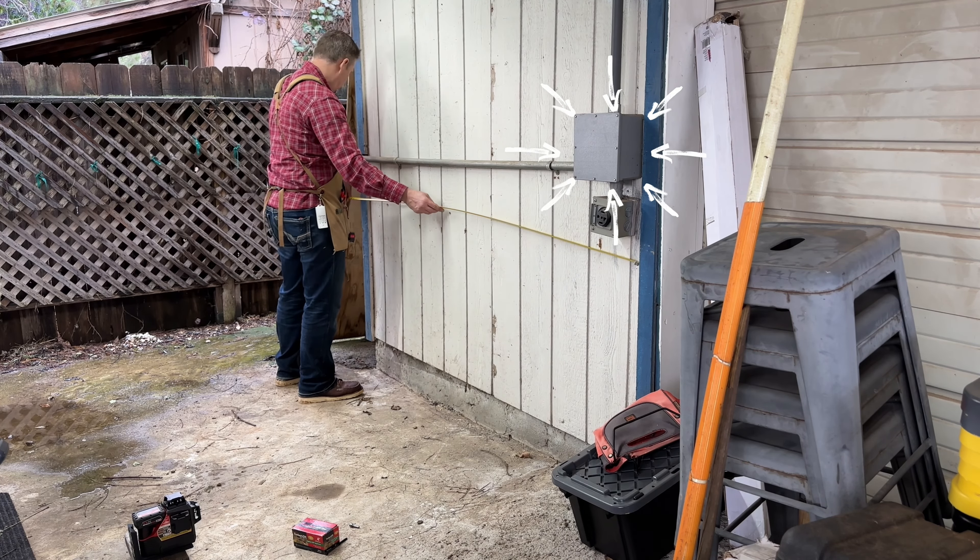If you're doing this from the inside of a building with exposed walls, then you know exactly where to put your cleats. Or if you have drywall, then you'll want to use a stud finder. In the shop, I'll cut the support studs to the desired length and add pocket holes for joinery, attaching them to the cleat and the shelf board.